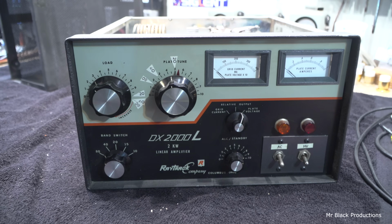Okay. It's all basically the same thing. We're going to put roughly 3,000 volts on the anode. We're going to have X amount of volts on the filament, the same as every other 3500Z box in the world. The only difference is this is a two-piecer like a Drake, like the infamous L4B, but not constructed like the L4B, but it's got really good parts in it.